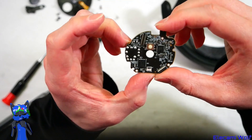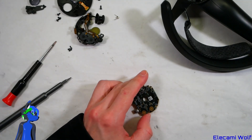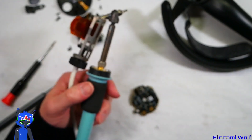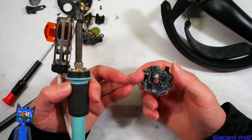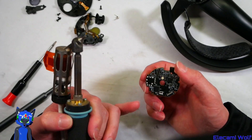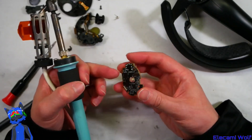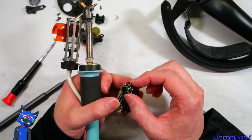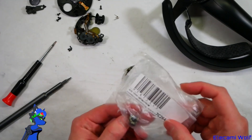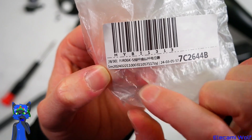At this point you're ready to replace the stick. You need a very high-performance de-soldering tool — something like a vacuum de-soldering tool. Feed a lot of leaded solder into all of the stick connections, give them a good suck, then do that a few times feeding more leaded solder in so it soaks through to the other side of the board and lets you suck out the whole solder barrel until you can see light through it. Wiggle each pin as you go, make sure they stay wiggly, and then the stick assembly will come out. Solder in a new one — they come from AliExpress, eBay, or probably Amazon, pretty cheap.